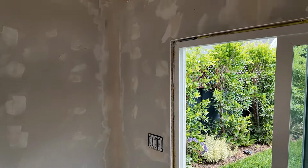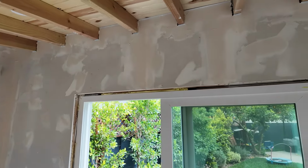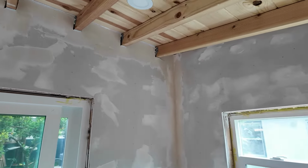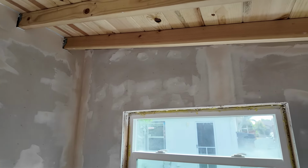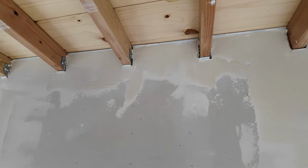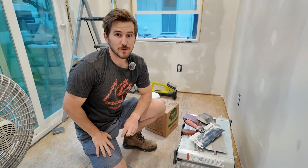Sanding this was super easy. So I'm gonna do another round of sanding tomorrow once this all cures, and then decide what the third coat really is and how to go about it. And if it's a really thin top coat, if it's a flood coat, which I read about. So you'd see that L trim really disappears on that second coat. So overall, another good, easy day with the drywalling. Gonna be moving on to coat number 3.